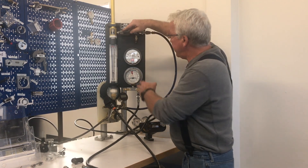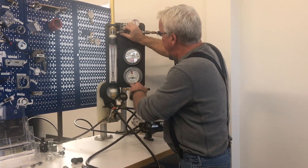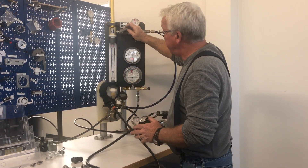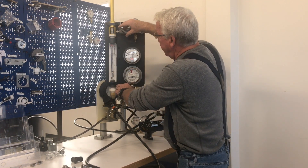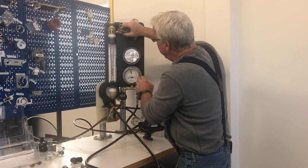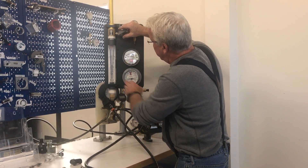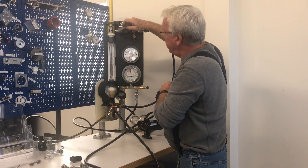After testing cracking effort and intermediate pressure, keep an eye on intermediate pressure for lockup or drift, and go ahead and continue to open the valve and run your flow meter up to a reference point of 5 cubic feet per minute and document your breathing effort and your intermediate pressure. Then continue up to 10 cubic feet per minute and document your intermediate pressure and your breathing effort.